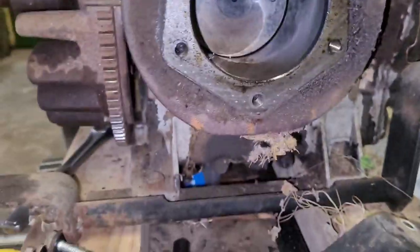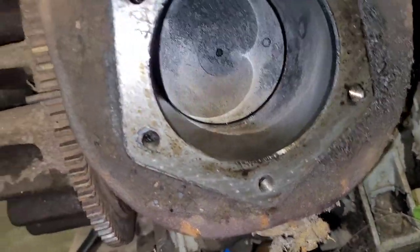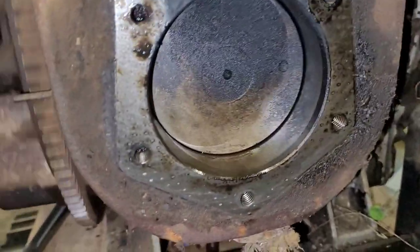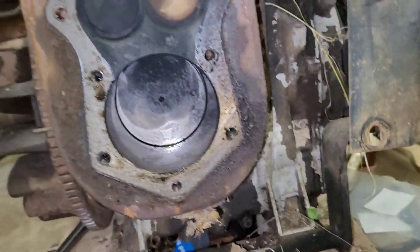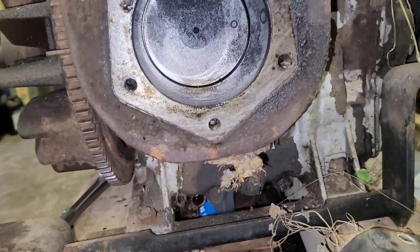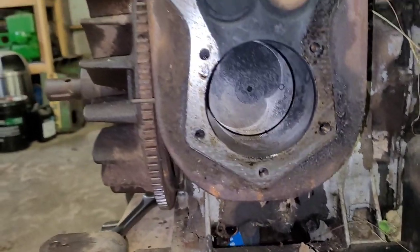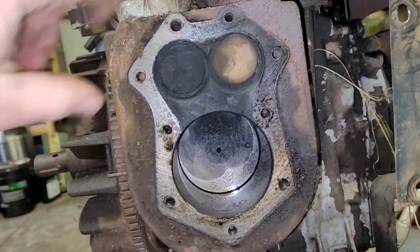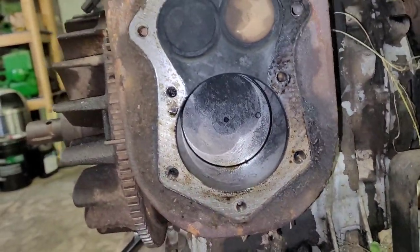All right, I pulled this head off and we got blown spots here too. Down here, everything's pretty much wet except the top. And again, we got a dang pool in here that I'll have to wipe out. But I'd like to put in here, for those of you who are going to be bitching that I went way tighter than it's supposed to, for shits and giggles, I checked this one and it was to the 16 and a half, 17 foot-pounds that it's supposed to be on both sides. Both sides were blowing out.